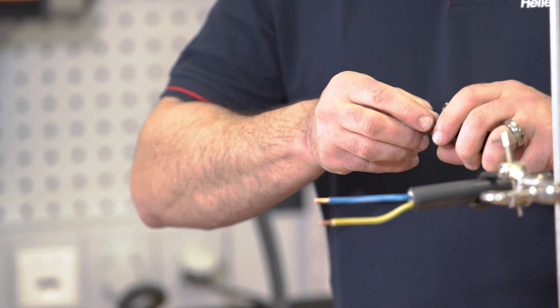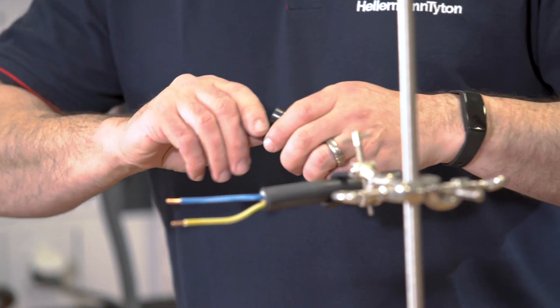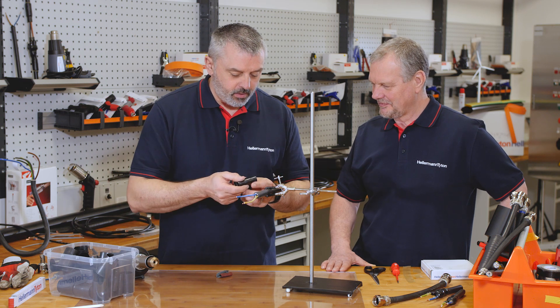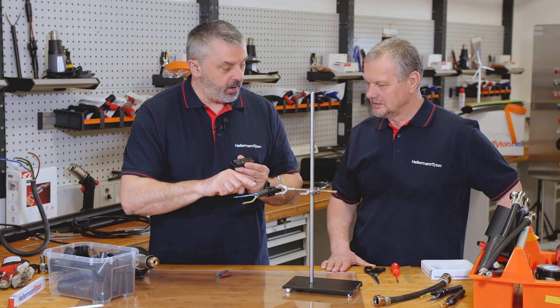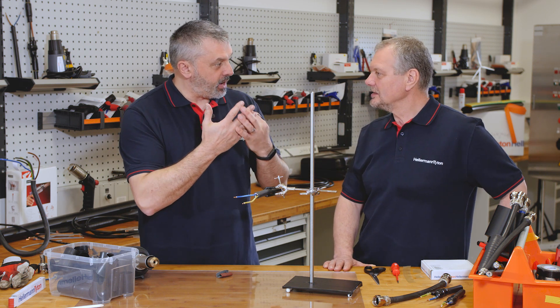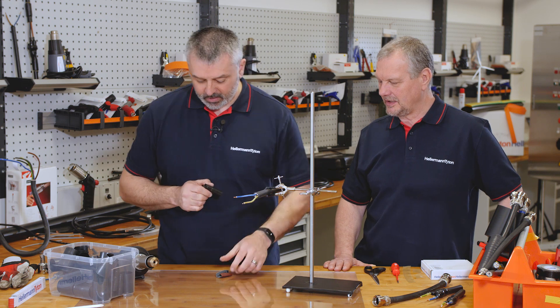So why is that then, Barry? One reason is it's very difficult to shuffle inside, and you can also roll the abrasive paper up and it fits nicely in the legs like so. But the key to the keying is this: this has been abraded this way, and this has been abraded that way. So when the two come together they create a cross, so you get an even stronger bond.